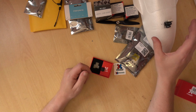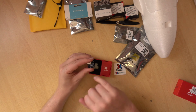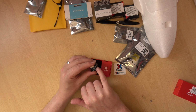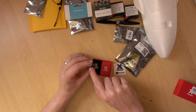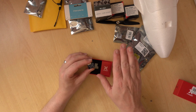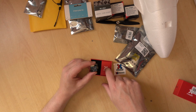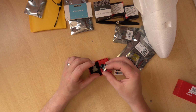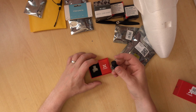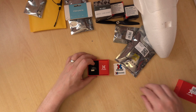But yeah, that's a micro size camera, which is what you need for up in there. FPV cameras are pretty straightforward. For most of them, with a flight controller, all we need is a video output, ground, and power in. That's all you really need to set up. This side here is for the little control pad, which you get in the box, so you can turn off their OSD settings if they have any, or adjust the picture. But that's the most basic option.